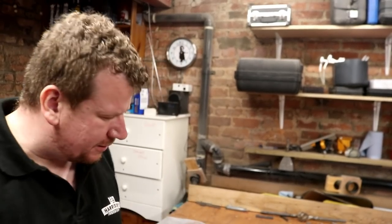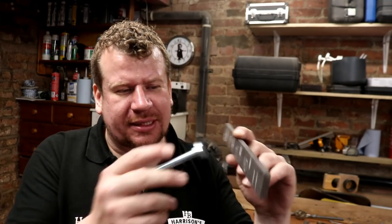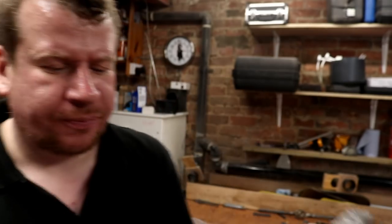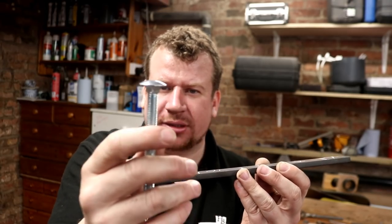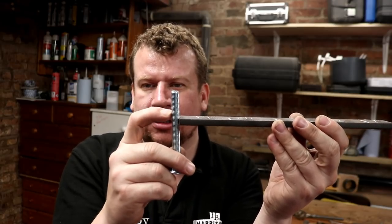So my plan for the brackets is going to go something a little bit like this. We're going to take a little bit of the 8mm by 30mm bar that we've got as an offcut from yesterday's fabrication, and we're going to cut it, excuse me, hay fever, into 60mm segments. And then from those 60mm segments, we're going to weld on a bolt, like that in the middle. But before we cut it, we're going to drill holes, one hole either side for a screw, and we'll weld the bolt smack bang in the middle. With these coach bolts, I'm just going to chop this top section off like that and weld it straight on. And then we can put the actual railings on. We can use the bottom nut to adjust the height and the top nut to tighten it on. And I think that is going to be sufficient.